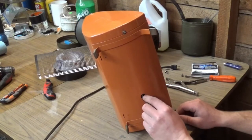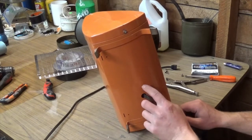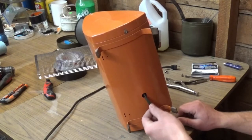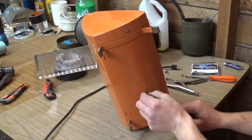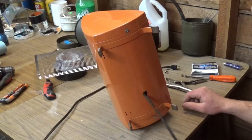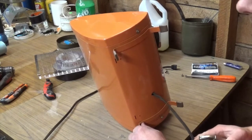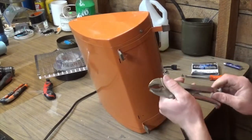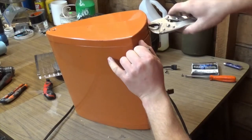You can see I'm missing my grommet. There should be something there - whether it's even just a simple knot in the cord on the other side of this hole on the inside, just so you can't reef on the connections in there. Super preferably, use a grommet - one of those squeeze-down kinds that squeezes the cord together when you pop it in, not just a regular old grommet that the cord can still slide through freely. Knots work, but if you do end up yanking on this a lot over time, this tin could start cutting into the cord.